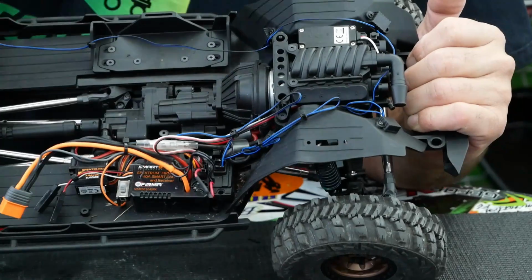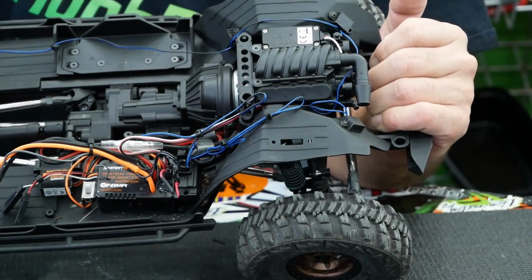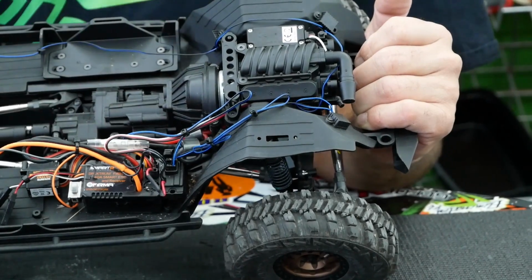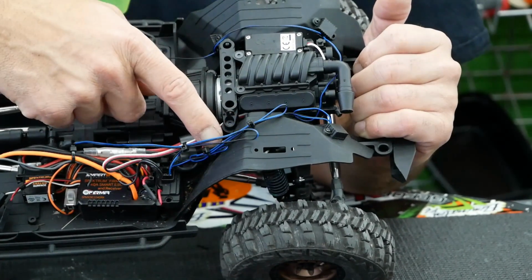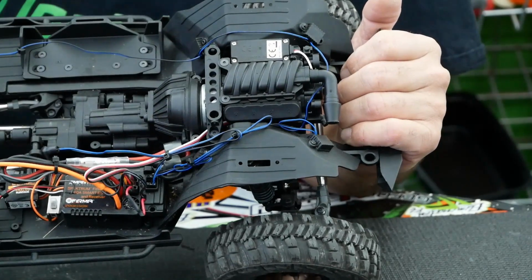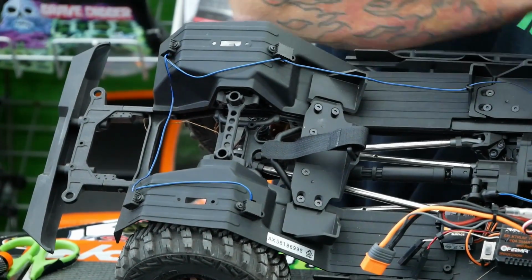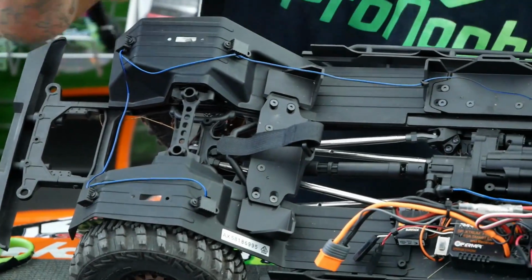If you cut the hole nice and fit, the lens itself is recessed to pop down inside the hole, so you actually get it to clip in, 1 screw holds it in. This one I cut the hole a little bit bigger first, then realized I was making a mistake. The rest of the holes after were click in and then 1 screw to hold it down. One little tiny, I think it was like 3 by 1.5 binder screw or a self-tapping screw.